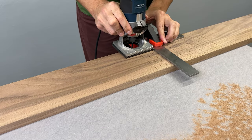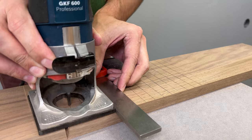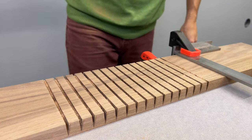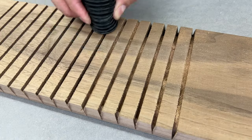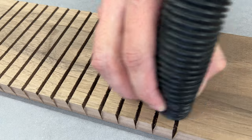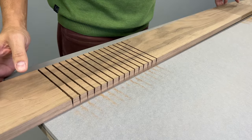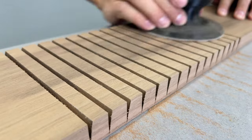If you've already worked with spiral router bits, you'll know how awesome they are — they cut extremely well, leaving almost a perfect surface. As I'm using a V-shaped carving bit and made all the needed depth in a single pass, only part of the dust was pulled out and the rest I had to vacuum. Some surface sanding was needed to remove small tearouts.